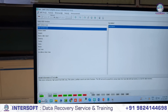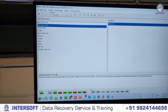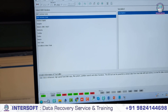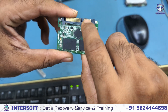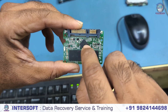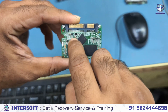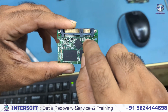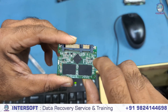We will find the SATA pin first and check the SATA connection before going further. We will check on the microscope and show what the continuity of the SATA pins looks like. The SATA pins go from the connector to the MCU controller. The power section is most likely okay because it consumed 0.07 ampere. In the second part, I will show what the problem is with the SATA connector.